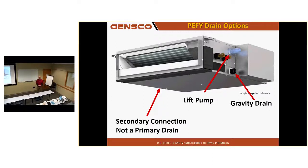It gets installed upside down because they see the drain outlet and they think, oh, that's the bottom of the unit. And of course the float trips as soon as you turn the power on, it's tripped and it gives you a drain alarm error. I just turned the unit on and the drain's tripped on. Float's telling me I got a drain error. I don't have any water in the unit.